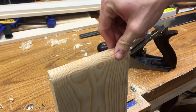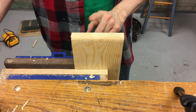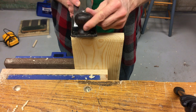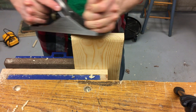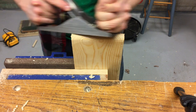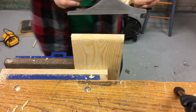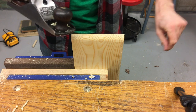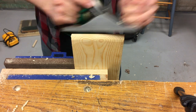I flipped the board around and I'm going to go ahead and put the bevels on this side like I did the other. Hopefully this gives you just a different angle. Again, I'm going to be shooting for about a 45 degree angle across the top and also skewed 45 degrees this way, and I'm just going to start taking my shavings and creating that first bevel — about a fat quarter roughly across this side. Just checking to make sure I'm even. I'm a little uneven on this side, but don't be afraid to just take partial swipes to even it out.